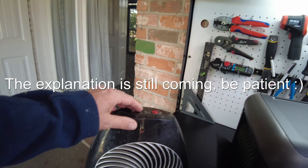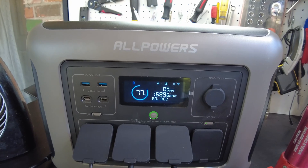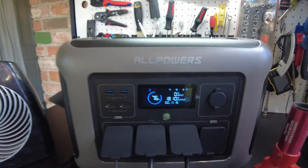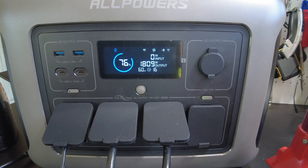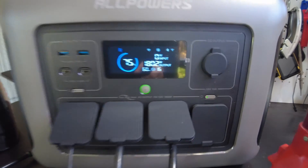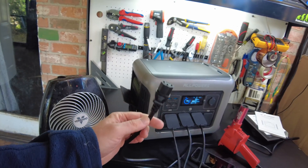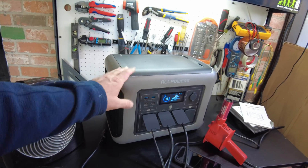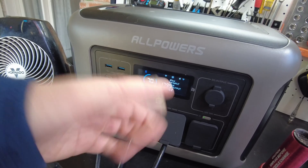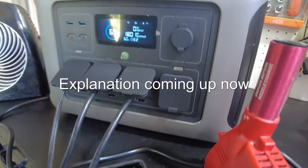Now I'm curious: with AC disconnected, I run the heater on high and the heat gun — we're doing almost 1,700 watts and still running fine. Adding the fan, we're exceeding 1,800 watts now, right around 1,803 watts, and it's running everything fine at maximum wattage. So if you've got the AC input plugged in, you can't get as much wattage out — we're limited to around 1,500 watts in that configuration.